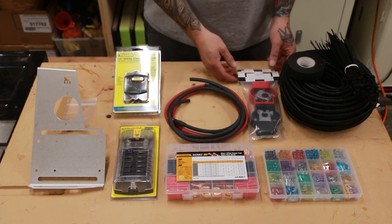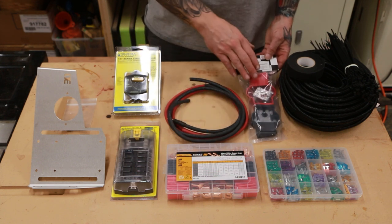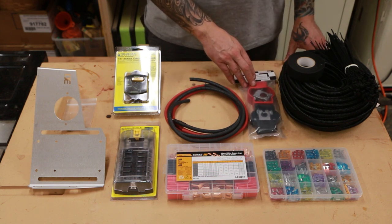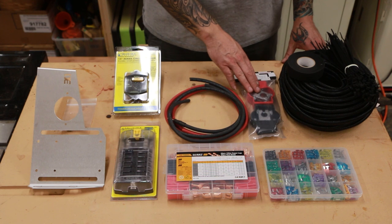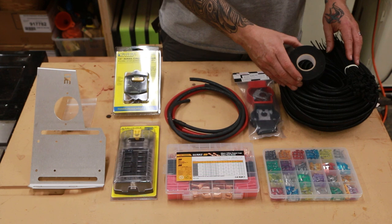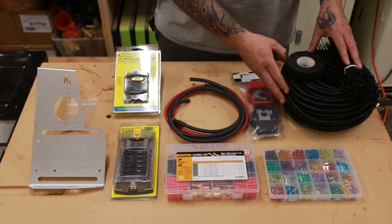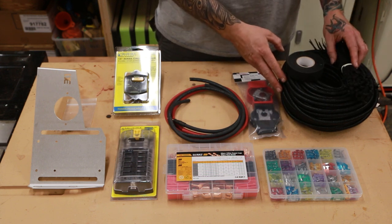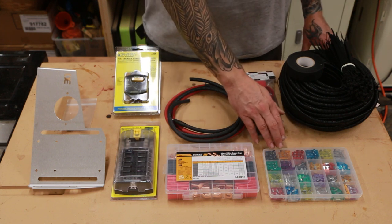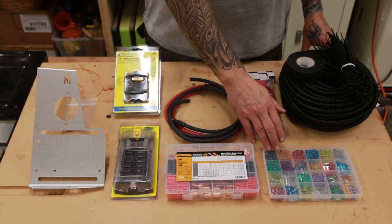Since I'll be adding cables from the battery to the fuse block, I've chosen to upgrade my battery terminals to a set of mil-spec terminals that will give a solid connection to the battery as well as more flexibility in the future. Other miscellaneous items we will need are fabric wire loom wrap, split cable conduit, and some zip ties to keep our wiring protected. Lastly we will need an assortment of blade fuses for our fuse block — fuse size will be determined by your accessory.